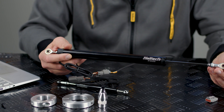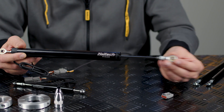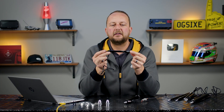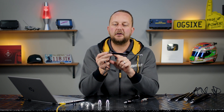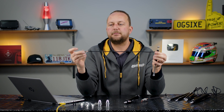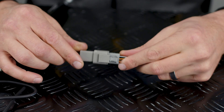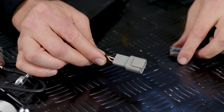We've got a thicker shaft of which a thinner shaft runs on the inside. We've got a spherical bearing on either end, so as this moves in and out we're measuring the distance based on a potentiometer inside here. We've got some wiring that comes out the back — it's a 450 millimetre long cable that goes into our Deutsch DTM 3 connector, which has got a 5 volt, a 0 volt, and a signal wire.